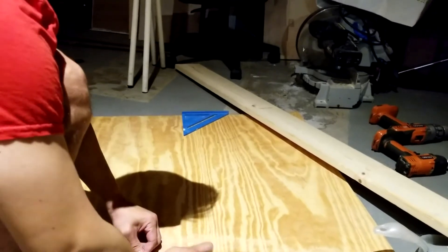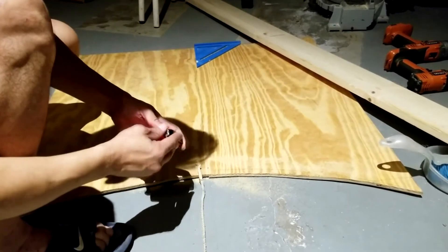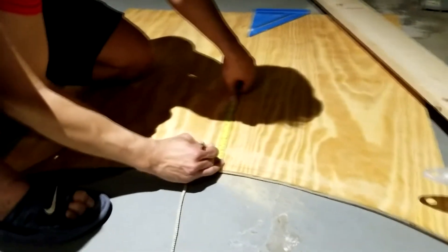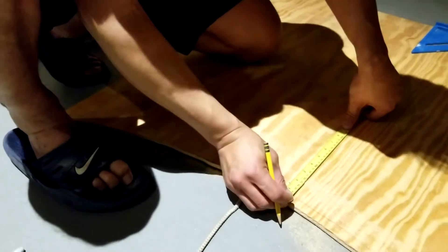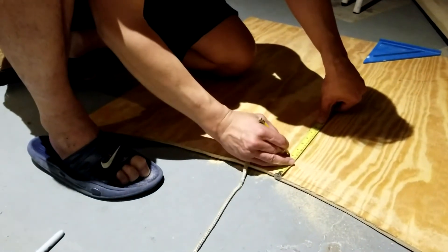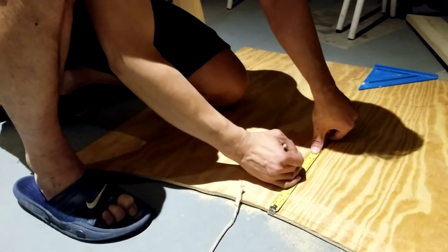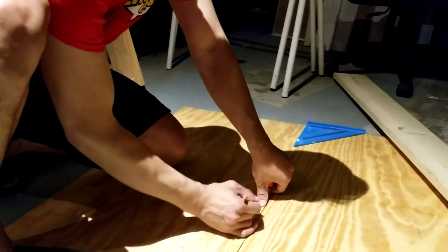The thickness of the front of the circle is going to be one and a half inches. We'll take a ruler and measure out one and a half inches along the radius and mark it. You might ask about the blade width of the jigsaw, but I'm not accounting for that — it's probably off by a sixteenth of an inch anyway and will be covered by flowers. Marking notches at: one and a half, three, four and a half, six, seven and a half, nine.